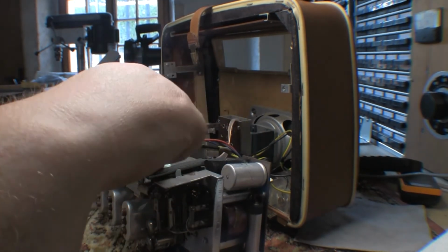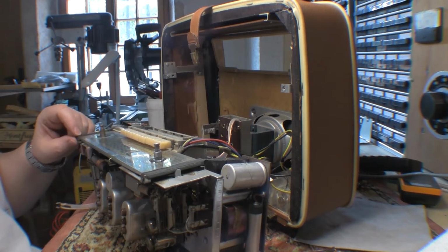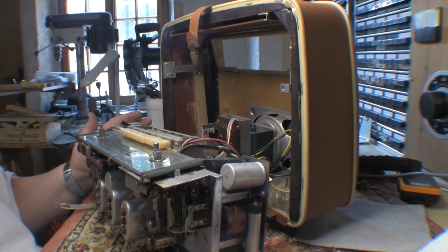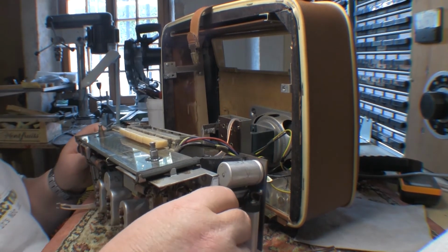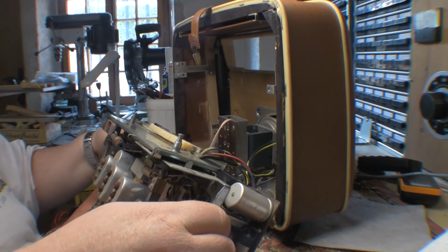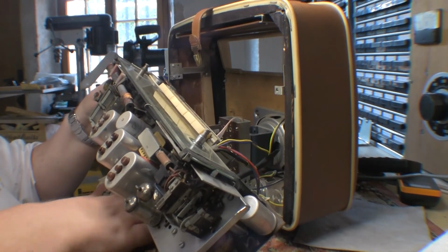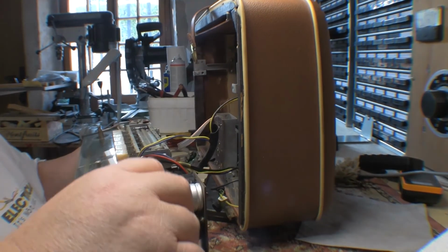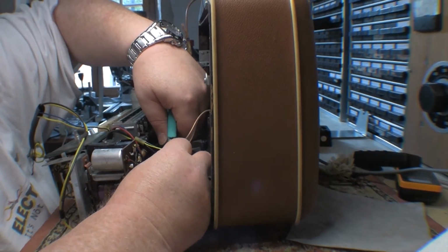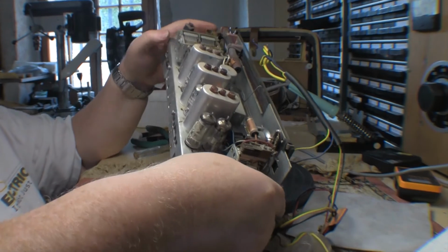I guess I'd really want to get the glass dial off of there so nothing happens to it, but it's held on with fabric tape. We gotta take it easy because there's 2 whole dial cords in here in a very small space, and gotta watch these little baby tubes here, man. I don't want to do anything too drastic here and cause damage. So this guy, I'll snip him up here. This guy 1/2 inch further along, and this guy 1/2 inch further along. Okay guys, there we go. We got a chassis we can work on.